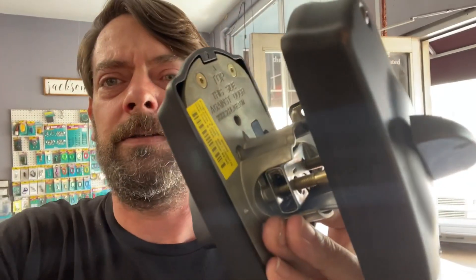I'm going to convert it back to a Schlage with a plug I've got here and then change the programming code. With these locks, the programming code is on the original directions and on the back of the lock. When you hard reset a lock back to factory settings, if that programming code has been changed and the sticker was removed from the door or the inside of the lock — that little yellow sticker — you still don't know the code, which makes the lock pretty much null and void.